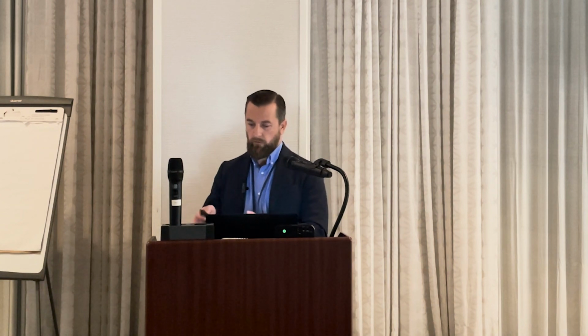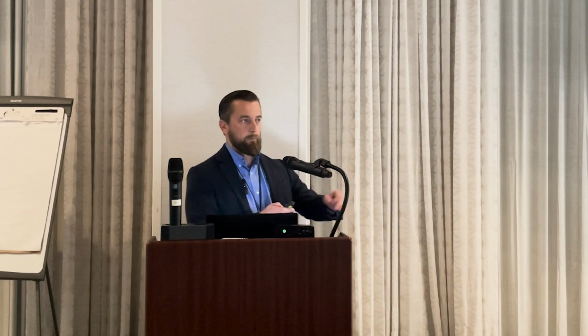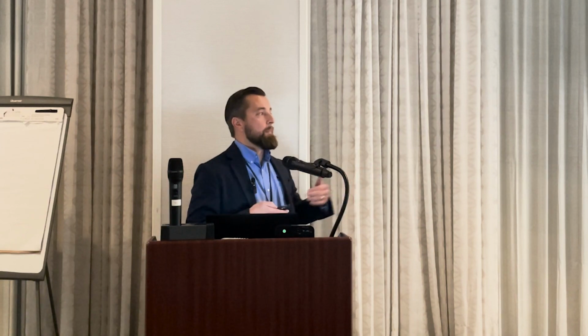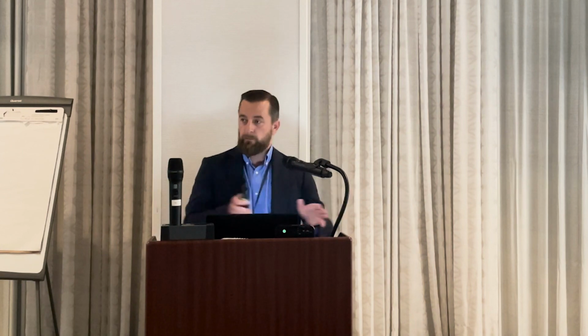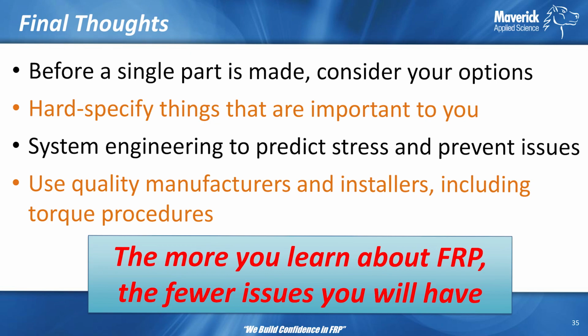All these things are done front end. I mean, you're doing your pipe stress analysis, ideally, where you do the correct support system. So we are eliminating all these potential variables as much as we can up front, so we can at least say that's not the issue. Jeff made that point earlier. There were good installers, so you could at least say anecdotally, my guess is that's the least likely scenario, right? So get as many of those as you can that are the least likely scenarios, so then you can focus on the ones that are a little bit more variable, like field installation.